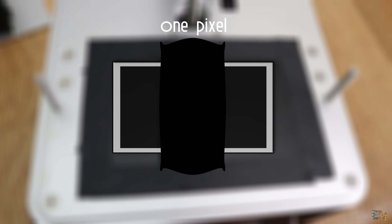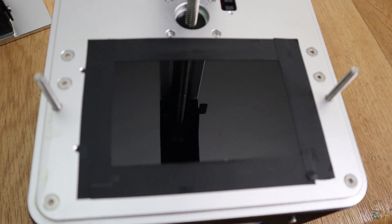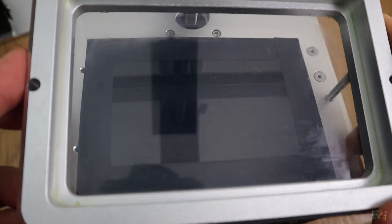To achieve the shape of the mask, an LCD is used. LCDs work with polarized pixels — when the pixel is vertical, light can pass, but when it's horizontal, perpendicular to the light source, the light cannot pass. So the LCD creates the mask. So inside we have the UV light, here the LCD screen, and the resin bath. Let's get started with the printer.